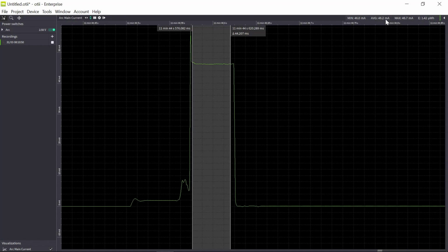So all of this data, how the device behaves, will be used in the second step. And this is where we will profile the battery according to how the device will consume energy. Second step is to profile your battery. This step is regarding evaluating and choosing the right battery for your device. And as input to this step, we need the power profiles created in the first step. Possibly you already have chosen a battery. Otherwise, in this step, you will also profile several batteries and in the end evaluate the batteries and choose the right one for your use case.